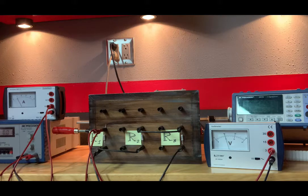Oh, okay, so now as you move along that table, see that box there? You're supposed to determine what the resistance is from equation 1. So from equation 1, which is Ohm's law, V is equal to IR. You can use the measured current and measured voltage to determine what the resistance of R1 is. By the way, when I calculated it, I got 110. Plug this in your calculator and yes, you are gonna get something different, but I just can't bring myself to write down a resistance with an actual digit in the ones place, because after all, our current only had two significant figures. So if I divide V by I, can I really report the answer to three significant figures?